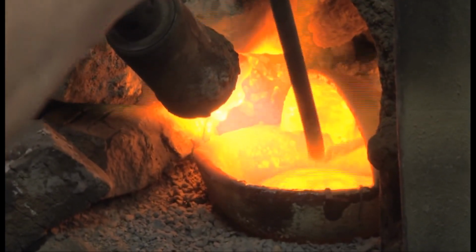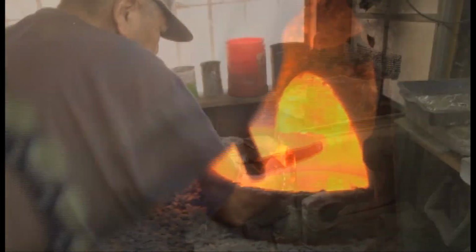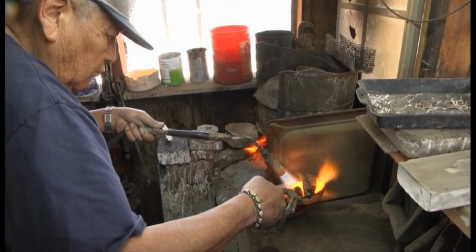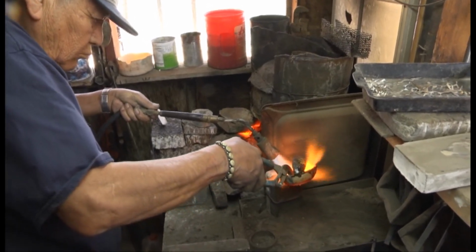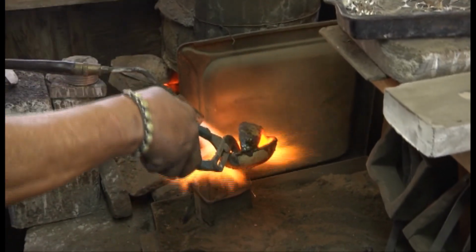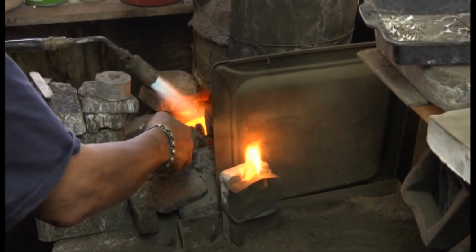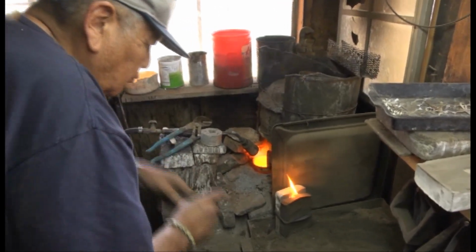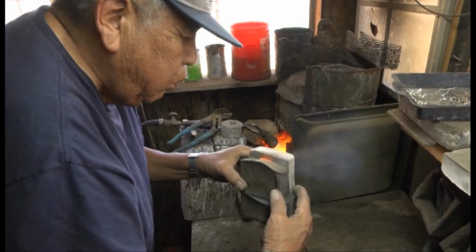He then removes the molten silver from the oven and carefully pours it through an opening carved at the end of the tufa. This is dangerous work, and a sure hand is essential. After shaking the stones to ensure the silver has reached all parts of the carved design, he undoes the strap and empties the casting onto a steel anvil.